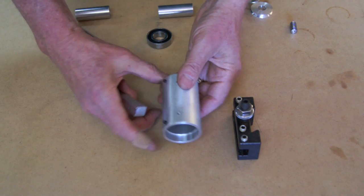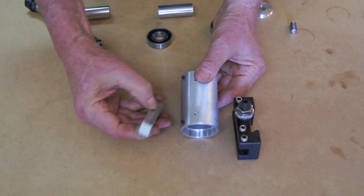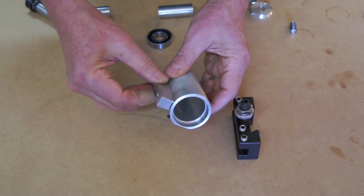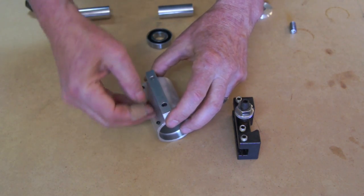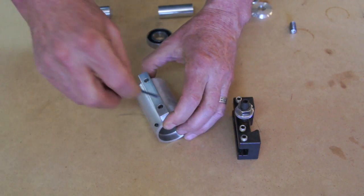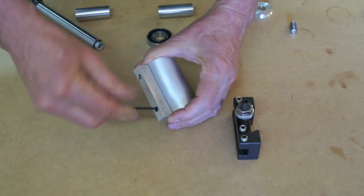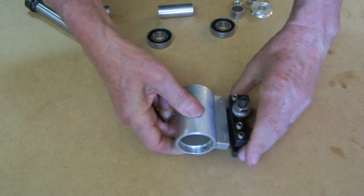To mount the big tube on the tool post, I just use a piece of half inch by five-eighths aluminum. I milled a little groove in the middle so that it sets square on the outside without wobbling, then put a couple of screw holes and screws in — that's how I attach this metal bar to the side of the work. It goes on like that, and then I can put that into my quick change tool post for mounting.